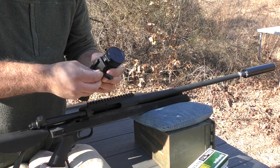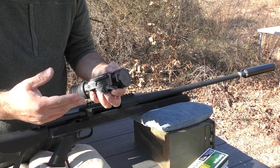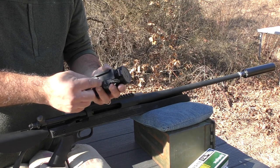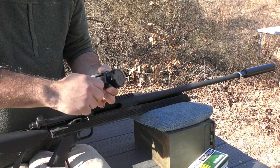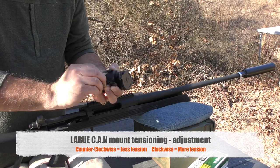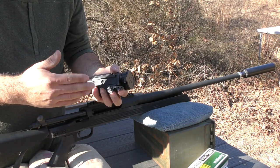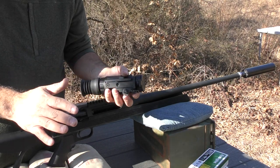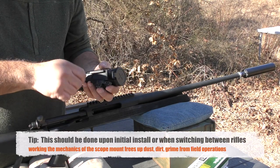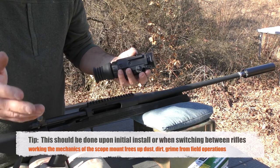There are about 29 clicks — a range of 29 different settings of tension. What I do to tension and mount these LaRue mounts on Bering Optic scopes to rifles is go ahead and take it counterclockwise all the way until it hard stops, then go clockwise until it stops. Do this three times — counterclockwise stop, clockwise stop, counterclockwise stop. All I'm doing there is seasoning the mount to get any kinks out. Sometimes there's manufacturing burrs, oils, grime. I'm just working the mechanics of the mount so that when I finally decide on a tension level, it's already been broken in, even though it's a brand new scope.